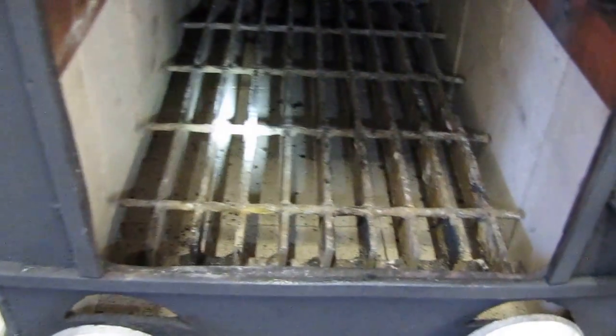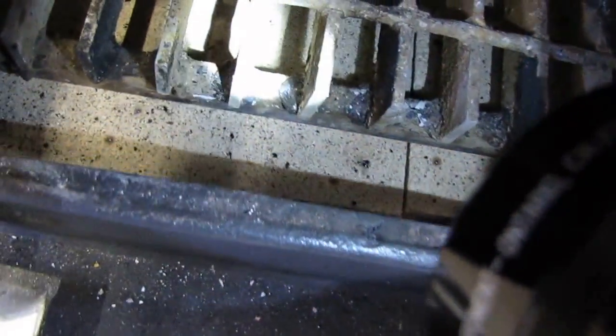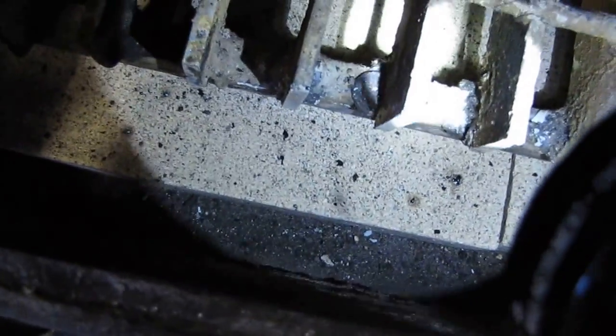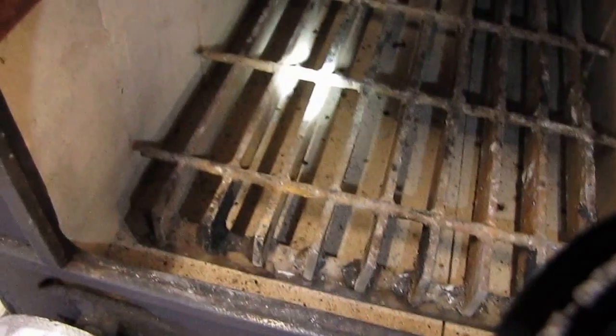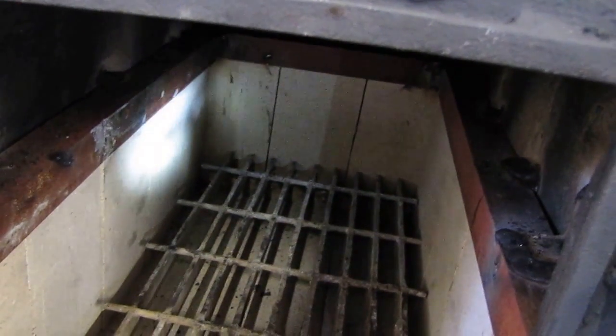We put some fire brick on my stove yesterday. He went and got the fire brick for me and we installed that in there, leaving about an inch or two inches away from the dampers. I've got to get the light in here — it's dark. Got the grate in there, got the fire brick going about halfway up the stove.